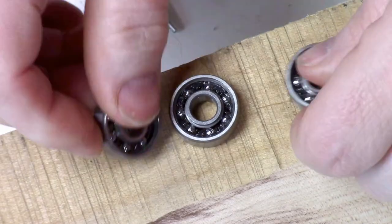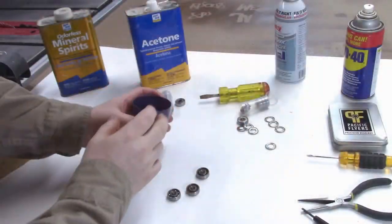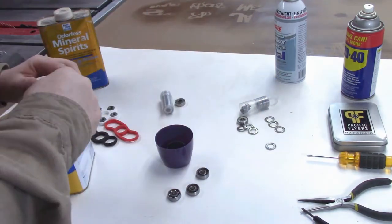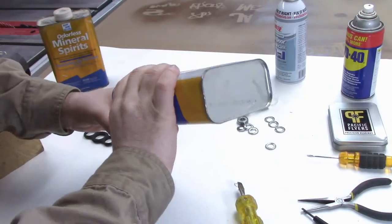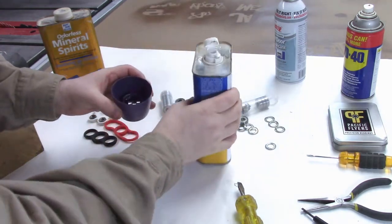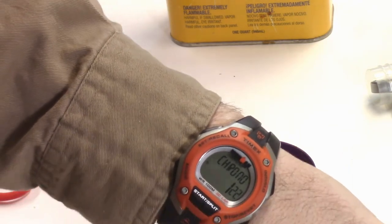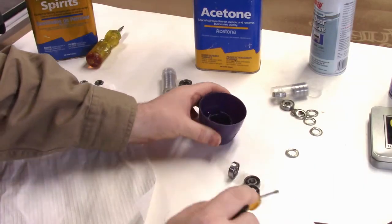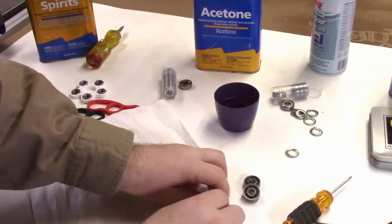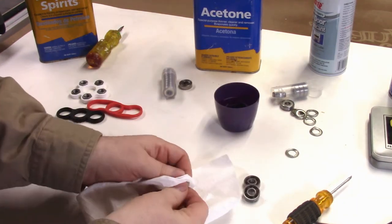So you've cracked them open — now they're filled with grease. I've got all three ready to go. Let me show you how to get that grease out. Any container will work, but I find these spray can lids work nicely. I'm going to fill it with some acetone, give it a swirl all around, and let it set for about 15 to 20 minutes. That gives it a chance to really break down the grease in there. Once you get them out, just wipe them down well.